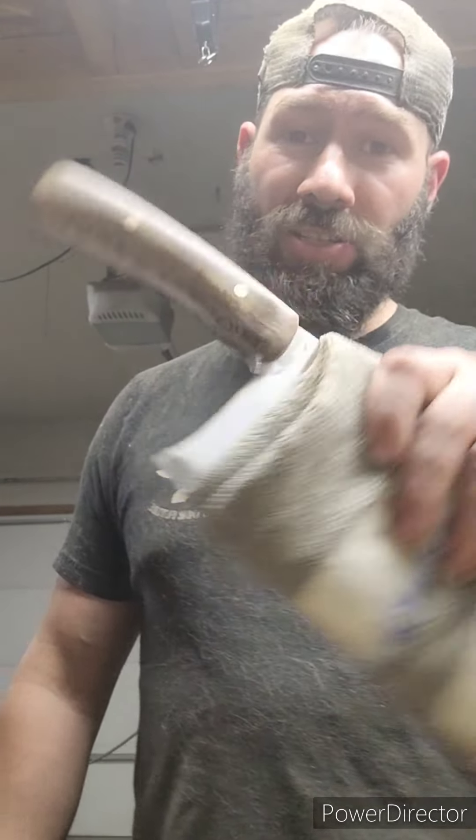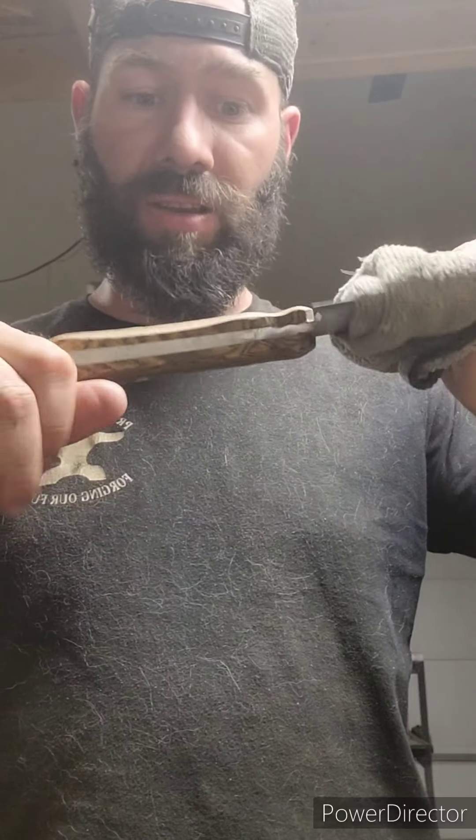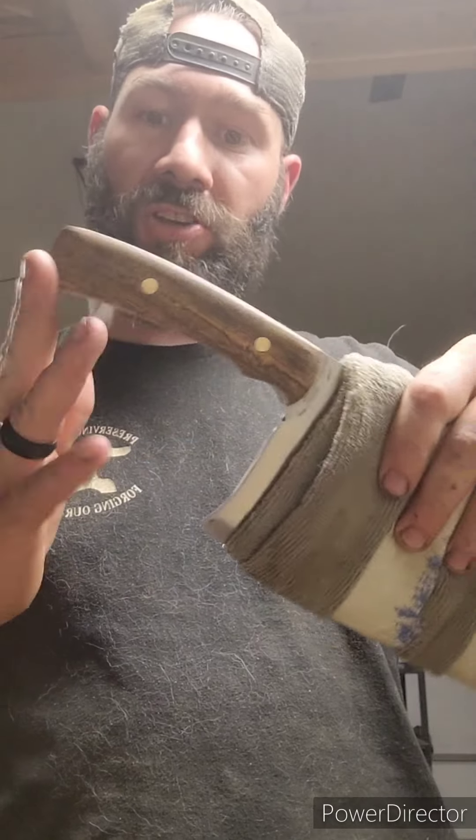Hopefully that helps. And there you have it folks — that's actually the end result. The epoxy is hardened. This is cleaned off with 120 grit, getting into the finishing phases of the handle and the rest of the blade. You can use a Dremel if you want; I like a file because I have more control and I can't mess up as fast. I think this is a really good way to do scales, especially before the epoxy is on — this will help you have more control in the finish and the cleanup is a lot easier, especially with that taping method. I hope this has helped you guys. Stay tuned for more episodes like this. If you have any suggestions on what you want to see made in the steps of knife making, let me know. God bless, keep your edges sharp, we'll see you next week.